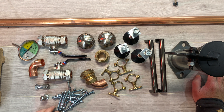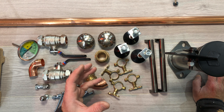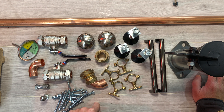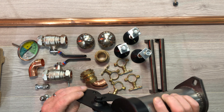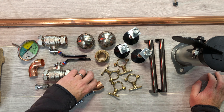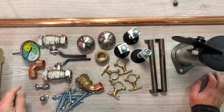The drum is definitely going to get sprayed. The high-temperature glossy paint I've been looking at needs curing, and for an even cure on a 44-gallon drum — it's a big space. If you've got charcoal only at the base you can get an uneven cure around the whole drum, and if that paint doesn't cure properly it doesn't fully harden and it'll be vulnerable. So what I did get was just a stove matte black. In contrast to all those nice coppery brass bits, that matte finish will just make it look interesting — a bit steampunk with the dial as well.